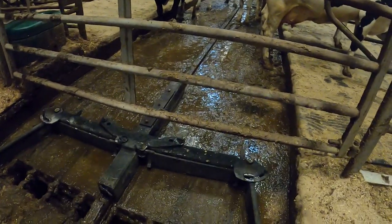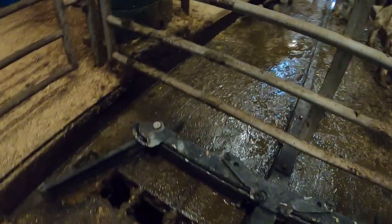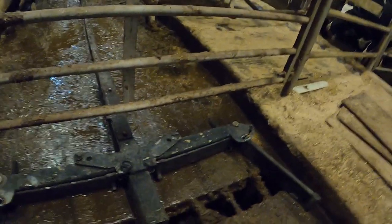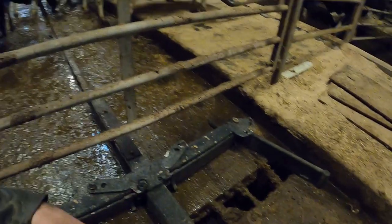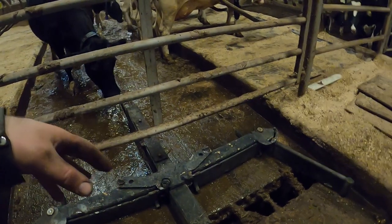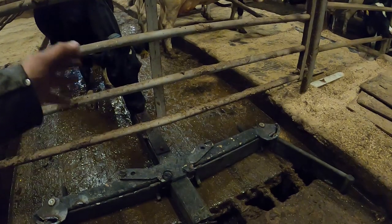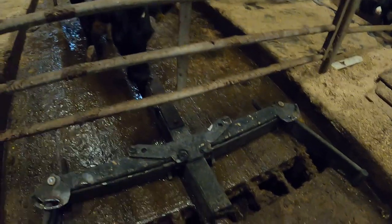We put the sled back in. It's pushing itself. So we welded a bunch of pieces, pretty much wear stuff, stuff getting worn out over 10 years. So what goes on, the whole rail slides forward. The sled locks in either going forward or reverse, pushes with it. Rail slides back, unhooks, comes back up, grabs another cog, pushes it again. Basically a giant ratchet strap.